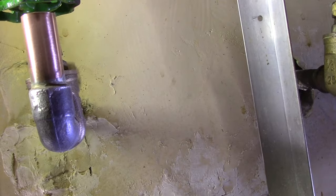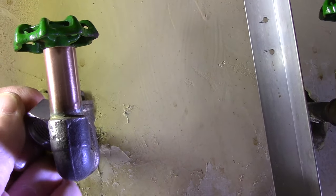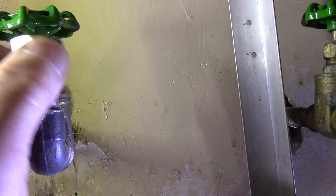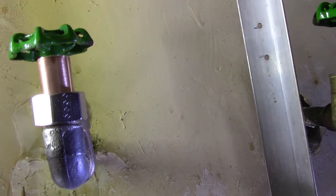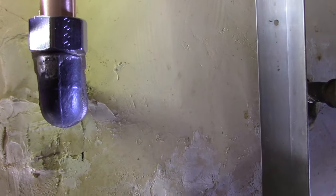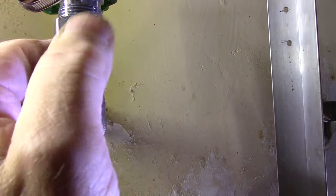Once you're sure it's nice and clean, grab a rag and wipe off any particles from the steel wool. Then put the nut down onto the existing pipe from the wall, put the ferrule over the top and make sure it slides all the way down, then the valve sits on top of that. Make sure the valve is all the way down on the copper pipe — it has to be in as far as it can go.